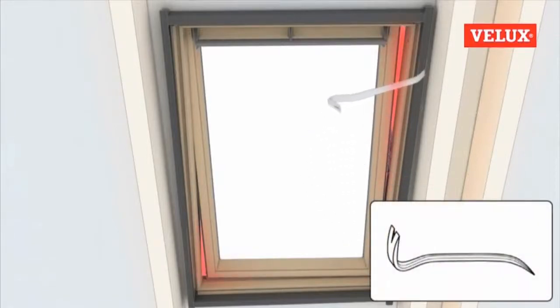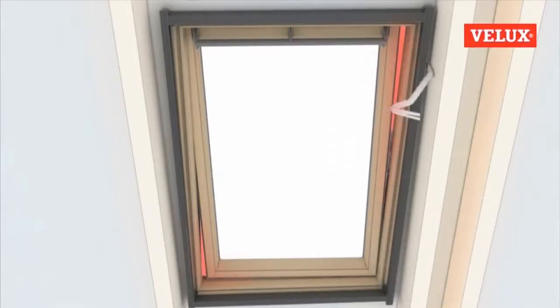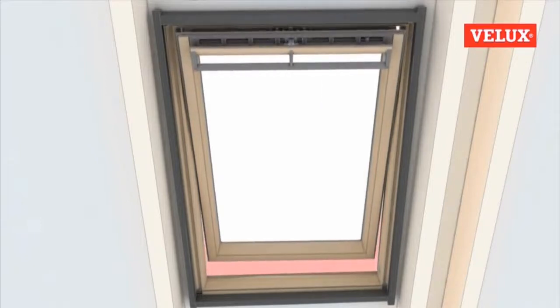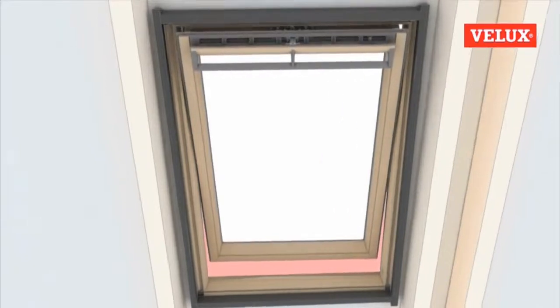If the space is larger at the top than the bottom on one side, a fine adjustment can be made with a crowbar on the outer edge of the frame to square the window up and bring it into line. Next, open the window and look at the opening at the bottom between the sash and frame. This should be even the whole way across.